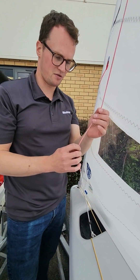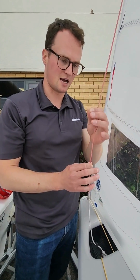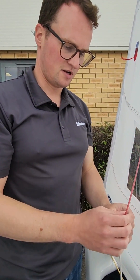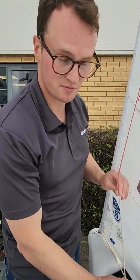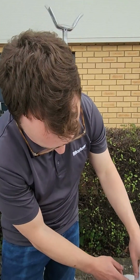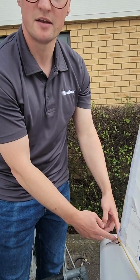Moving forward in the boat, in some of the early sails we were having a few issues with the tapered section of the kite halyard — it was just picking away a little bit. So before it wore away, we tipped it with some chafe cover, which puts our mind at rest.